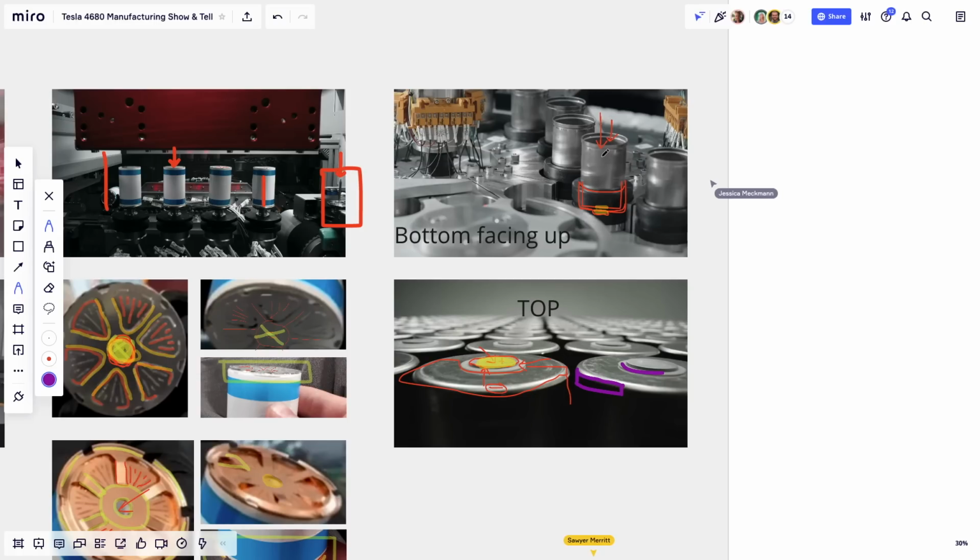We just welded through the hole of the anode current collector, this access hole here. We reached the inside of the cathode current collector, so we reached this point and welded to the inside of here. So now our positive connection to the battery is done. Now, what about the negative connections?